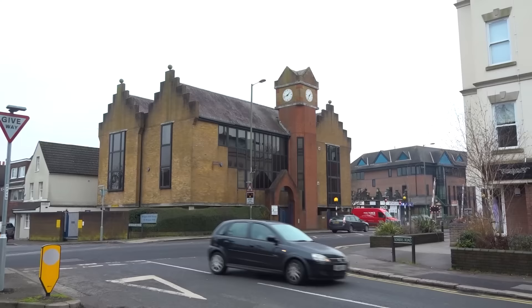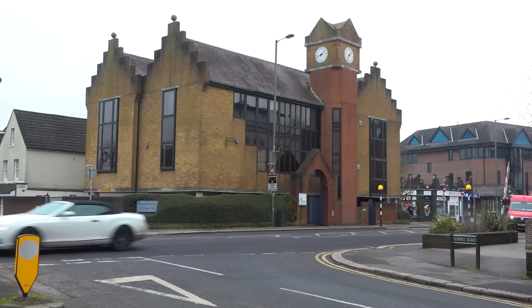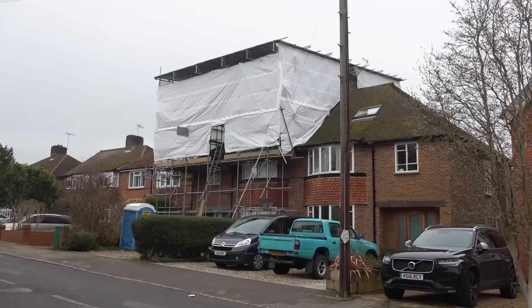I want to show you what is one of my least favourite buildings in the whole of Reigate. Although you might think they've made an effort - they've put a nice tower on there - some architect's bold vision no doubt, but look at the way that the water has run down the brickwork, the whole thing is looking pretty shabby. You look at the top of those parapets and they've basically forgotten the basic rule of putting some kind of decent overhang to shed the water. So you've got not only staining but all the pointing has been washed out of that brickwork. Somebody's got to get scaffolding and do major repointing work on that whole gable end.